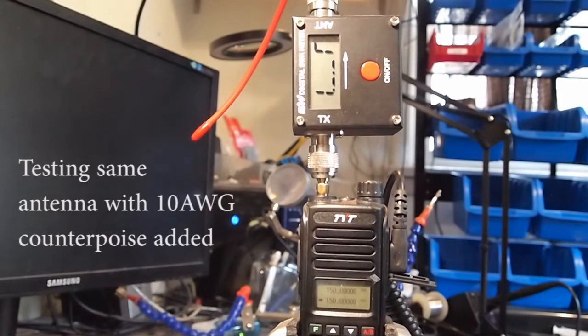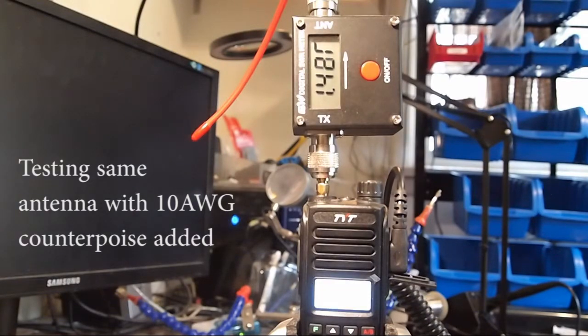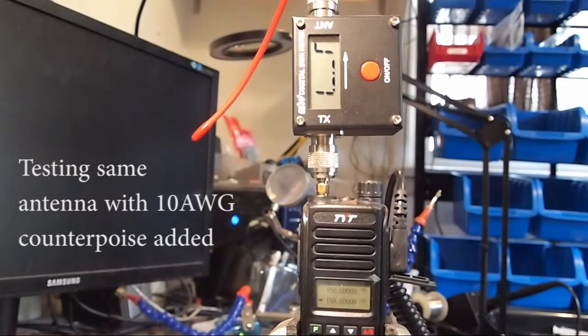So I thought to myself, why not, for fun, stick the counterpoise on there and do these comparisons while we're out and about with it. And this is the same one that I used when I did the field testing, as you see on Google Earth. So standing wave on here with a center-tuned 150, and we are on the high power right now, and we've got 1.48. Again, quite an improvement of about 25.